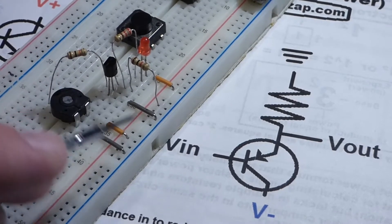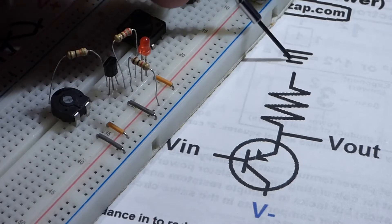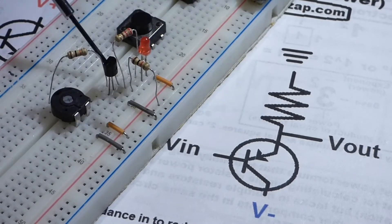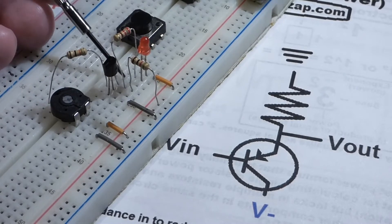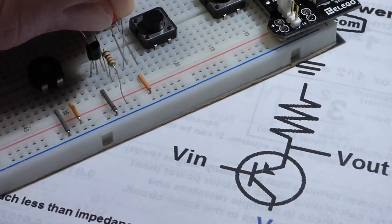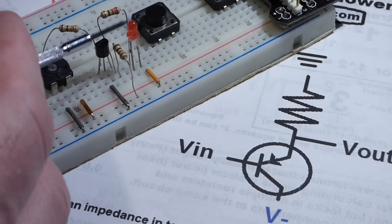The LED is still off. We have a resistor from the emitter to the positive rail - remember, ground in this case is the positive rail for this video. The voltage out is at the emitter. I also have a load here, so the voltage across the load is the voltage out. We have a protective resistor going to this LED, and the LED on the other end connects to the positive rail. The long lead of the LED is towards the positive rail, short lead towards the resistor, heading towards the more negative side. So this LED is forward biased and set to conduct easily.